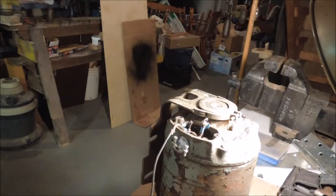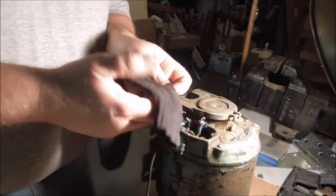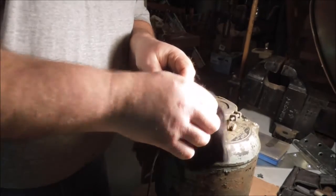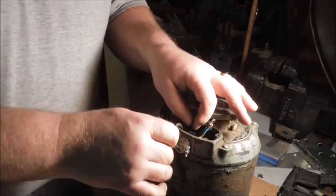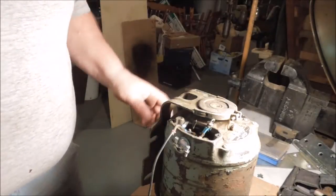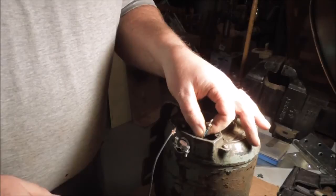I'm going to take these little electronic nippers and clip off the extra. Then I'll put a little denatured alcohol on a rag and wipe off the end of the wire. I'm going to solder this extension onto it, then slip a piece of heat shrink tube over the top of it to reinforce that insulation.